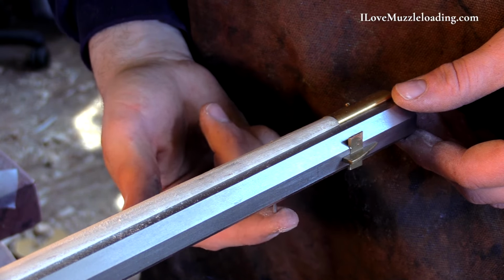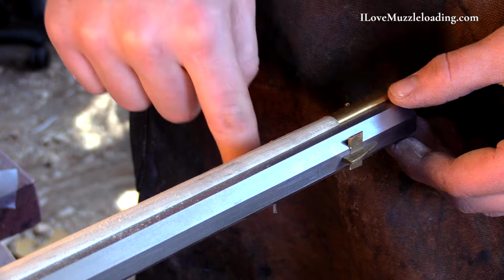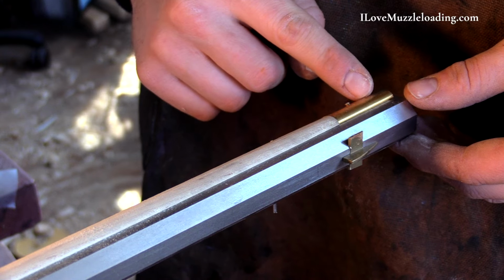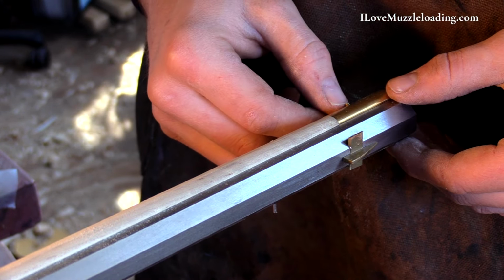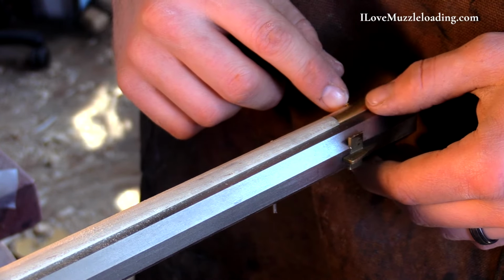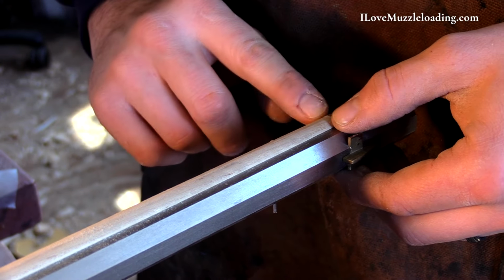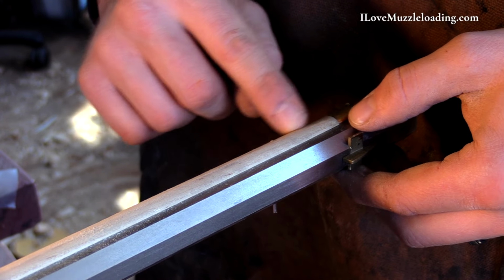Out here at the muzzle, you can see right here where I'm tapping with my finger. I've pushed my barrel pin through so that I can work this side while keeping this whole construct stable. I'm going to bring my sandpaper out to this nose cap, and according to Jim's videos, we're going to file this screw end down a little bit in our nose cap before peening it to create a rivet with that screw. And out here, our forend, just like with our butt plate and the other hardware, I'm going to go ahead and try to match my nose cap to my stock.